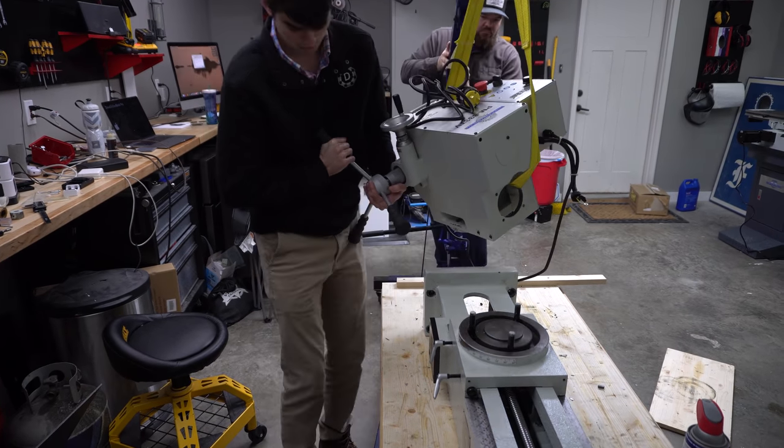The next and last calibration that I'm going to do on camera is going to be to tram, or adjust, the tilt of the spindle. In CNC milling, we want the spindle to be precisely 90 degrees in respect to the table. It's easy to adjust the angle on a benchtop mill because many of these models are made to tilt so that you can drill at different angles.